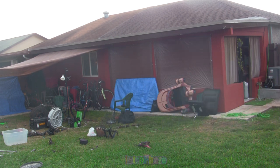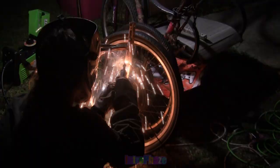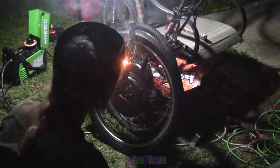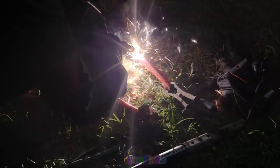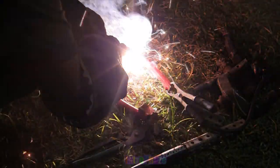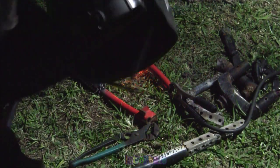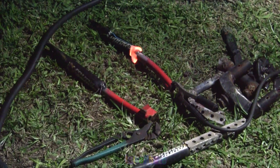There's literally no real documentation on the long-term effects of welding fumes, but I was getting sick over and over — I would weld and my throat would start burning immediately afterwards. These masks don't work; they're useless. The helmet obviously protects your eyes from arc flash and white blindness from sparks. But do not weld indoors — weld outside. Find a day where it doesn't rain, or build some sort of open-sided cover over your welding equipment, like a large shack that's open on all four sides, because these fumes are horrible.